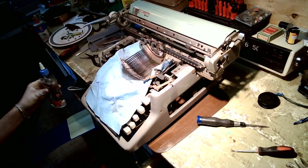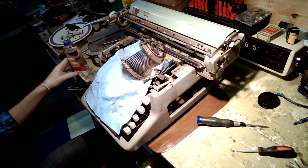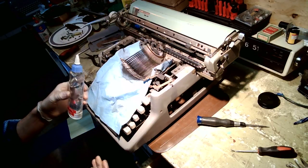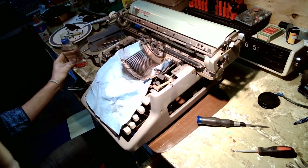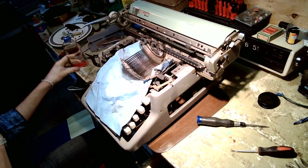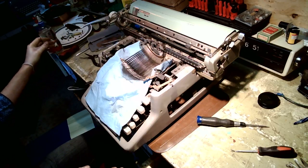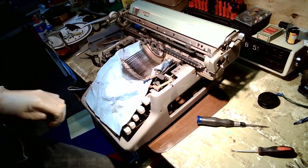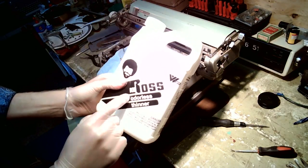If you were to bathe it in isopropyl alcohol and then let it sit outside while it was soaking wet, yes, I can imagine it's going to create some problems. You use this sparingly. It is a wonderful product to use on typewriters to clean type bars. It will neutralize rust. It is an excellent dirt remover. Don't frown too hard on isopropyl alcohol. It works very well.